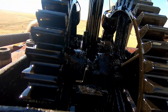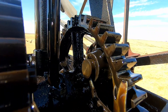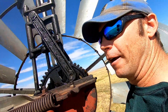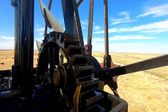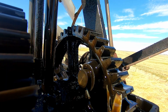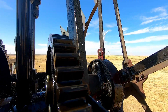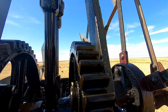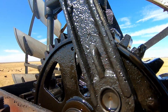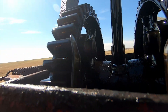That's telling me that this old windmill here has probably only got another couple years in it. I don't know if you can see right where that key is there that's holding that one pin in. If you look, there is a space right there where that silver key is running through — about an eighth of an inch or so. That's where my clanking's coming from. I could go ahead and swap it out of that keyhole. See, there's a pin there, and there's a pin there on this other side.